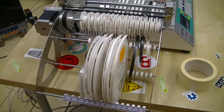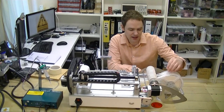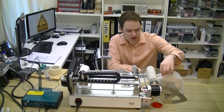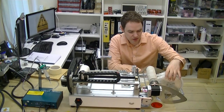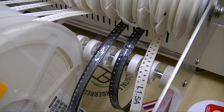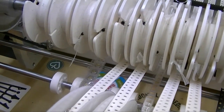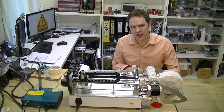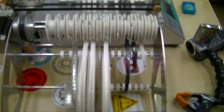In populating our stack, our strategy was to put the most common, inexpensive stuff that we're never going to change at the back, because it's harder to change a reel in the middle than it is up at the front. So common stuff goes at the back. Smaller parts, especially tape strips, go up at the front because it's easier to work with them there. We have a lot of our parts in strips of 100, 500, or 1,000, and that doesn't work on the machine as well as a reel, but it is doable.